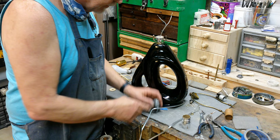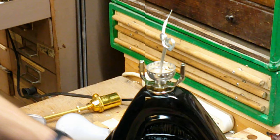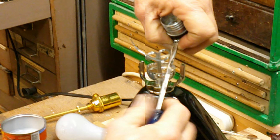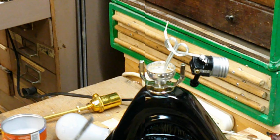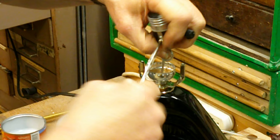Before we do that, there's one more step to ensure safety. Before you attach the wires to the socket, you have to make a special kind of knot here — sort of like a pretzel. Pull like that. There's a face here. The purpose of this is so that if someone is walking through a dark room and trips over a lamp cord, pulls it off the table, it's very possible that the wires could be jerked right from underneath these terminal screws. And if this knot's not in place, then you've got two bare wires plugged into the wall going down the inside of a steel pipe inside of a lamp, and the person's first reaction is to pick it up. If they pick it up by a metal part, they're likely to get shocked. So this is an important step — one that should never be neglected.